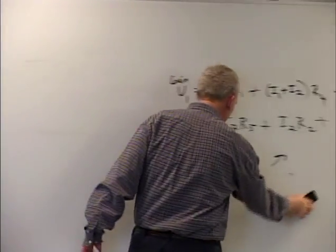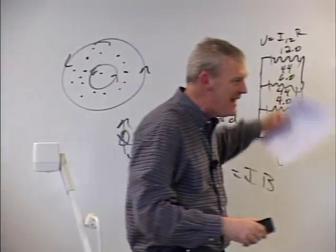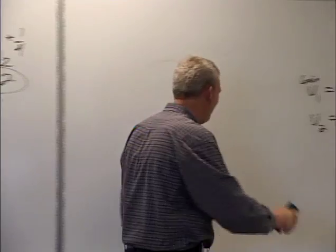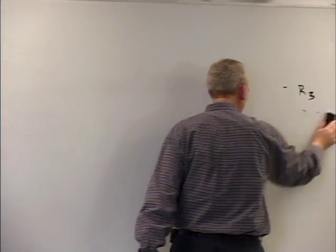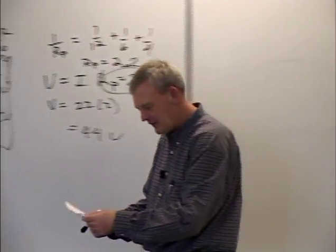And I felt bad because some of you went into the hole. Somewhere out of your deep dark past, you came up with the Q equals VC formula. That's not what this was doing. And now don't be shy, but how many of you got 2.3 seconds on this one? This is on your capacitor problem. That's wrong because it's discharging. You told me how long it would take to charge up to that. Okay, if you got 2.3.